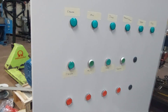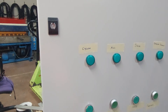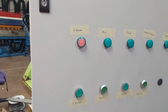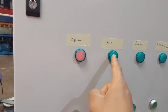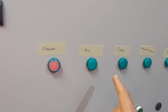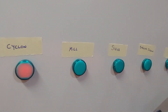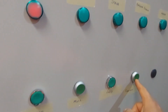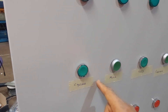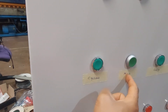I'm going to make a demonstration now of how the system will run. First, we start the cyclone. Once the cyclone is running, we then start the mill. Once the full speed of the mill is reached, machines one, two, and three will come on. When the timer has finished counting, you should be able to start the feed using the feed push button. There is a button for starting the mill, a start push button for the cyclone, and one for the mill.